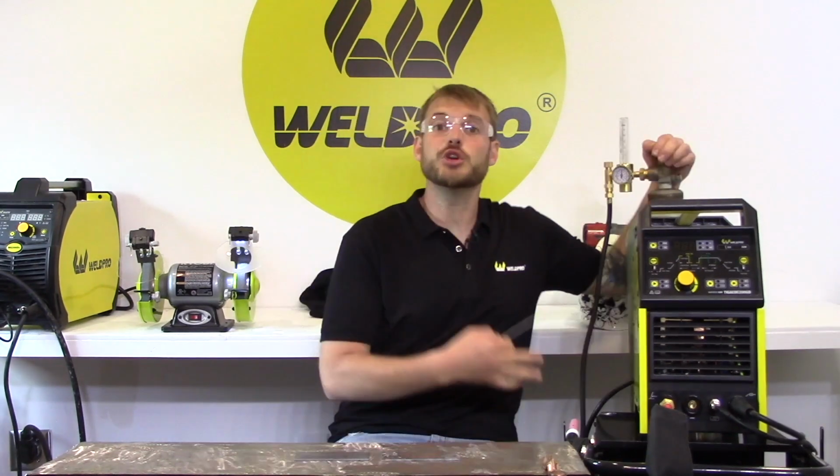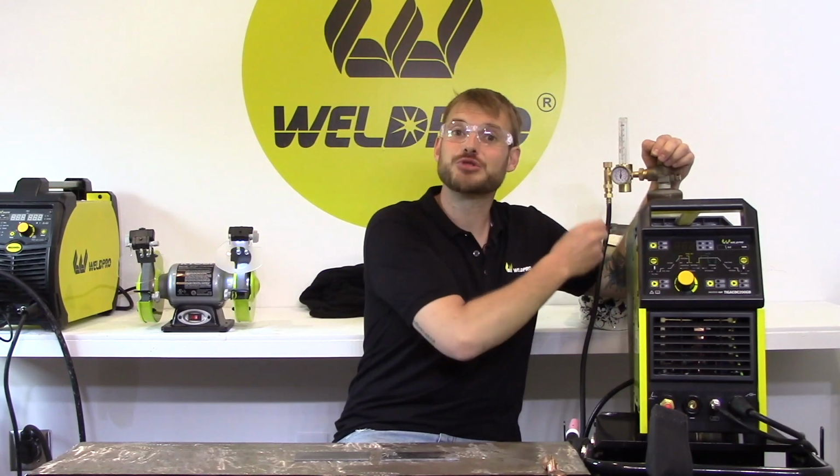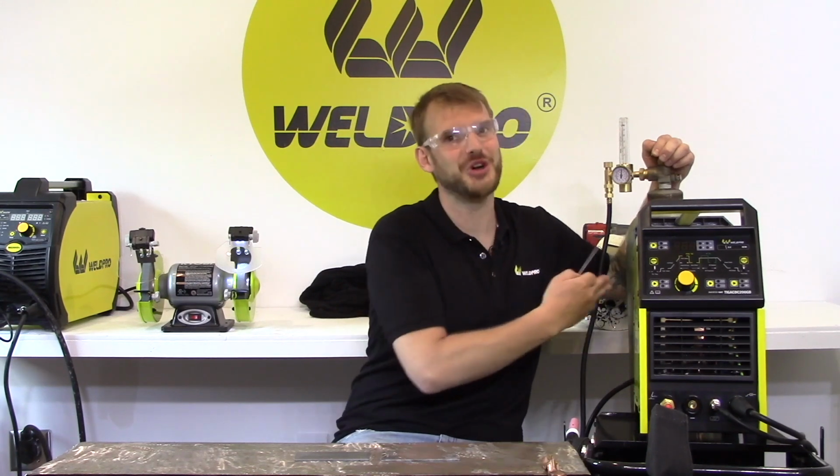A good habit to get into is after you've opened your valve, turn it back off. You can wait a few minutes, watch your pressure gauge. If the pressure gauge drops, you have a leak somewhere. If the pressure holds fast, you'll know you did a great job tightening everything down.